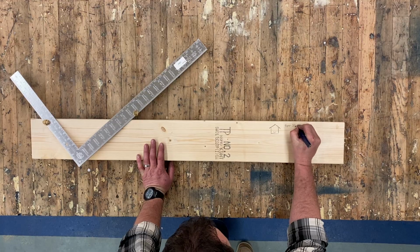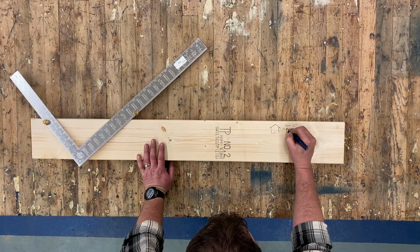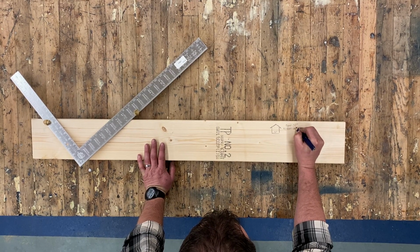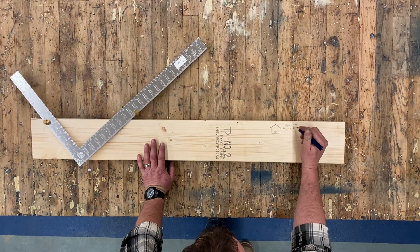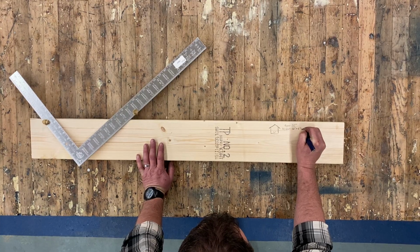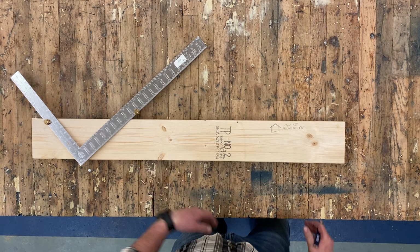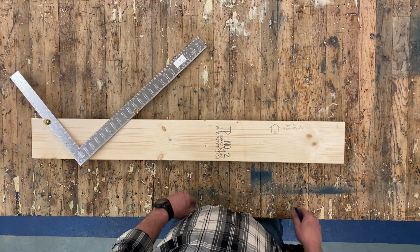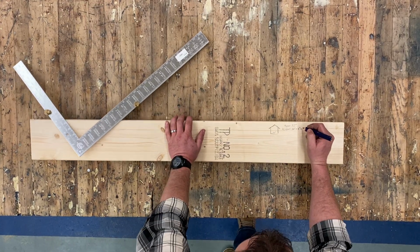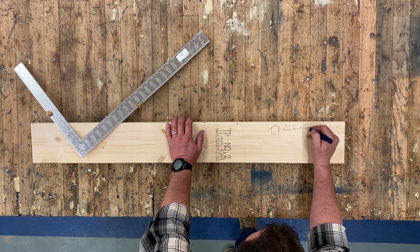All right. We've got to adjust that span for the ridge board. So I call it the adjusted span. Now I can do this in my head, but if you need to, you can use the calculator that I got you, one of the construction calculators. You do 32 minus 1 inch 1/2, and that is the thickness of our ridge board. All 2x material, our ridge board is typically going to be anywhere in the neighborhood of a 2x6, 2x8, 2x10, but they're all 1.5 inches thick. So 32 minus 1.5 inches, 32 minus an inch will be 31, minus another half will be 30.5.